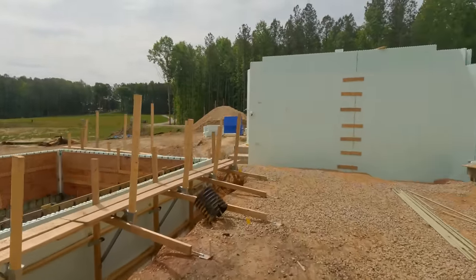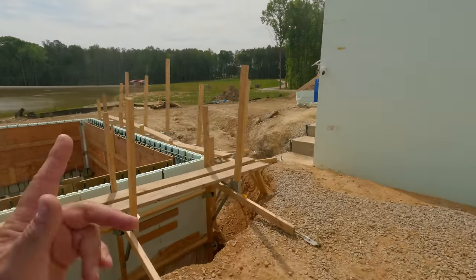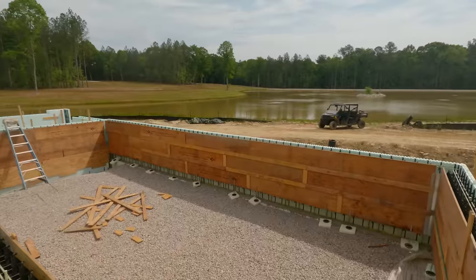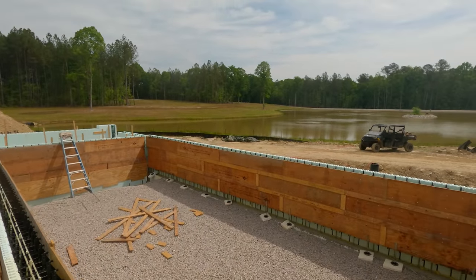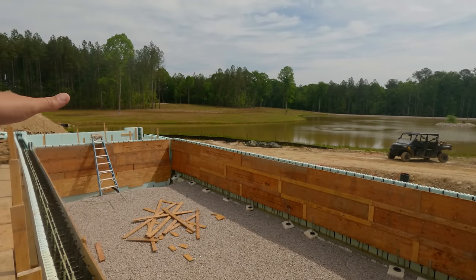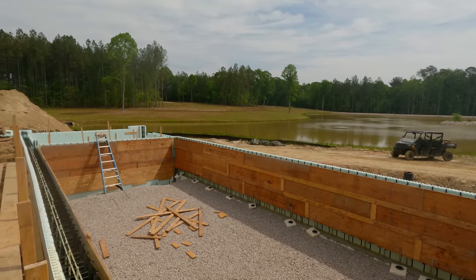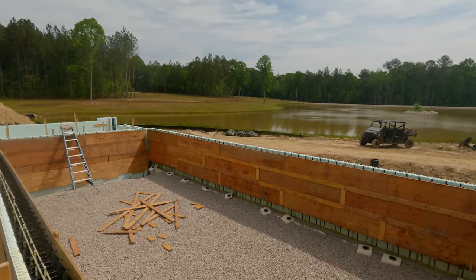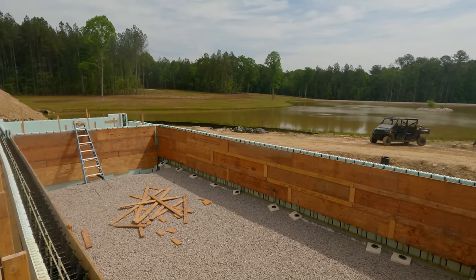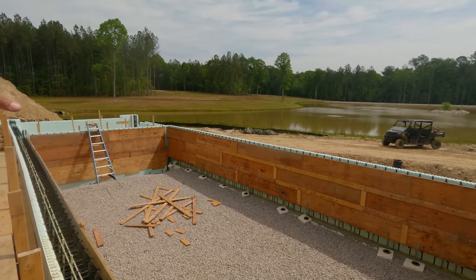And the basement after. So this is Friday, you're probably seeing this video on Sunday, so the next pour will be next Friday. That's the time I'm giving myself to build the sunshelf, which we're not going to pour the concrete for the top of. We're just going to pour the walls as we pour these walls. And then when it all cures, we'll put some filler in, and then we'll pour the top of it.